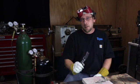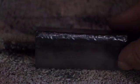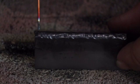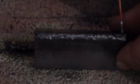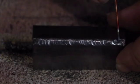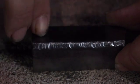We've got good penetration and a good looking weld. Back from the wire wheel on our second piece — let's see how I did. On the top, you can see that the weld laid in very nice into that groove. We've got nice nickels laid in. On the end, once again I got hot, but the rest of the weld looks pretty good on top. On the back side, I would call that excellent penetration — we've got nice rows of weld down below.